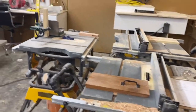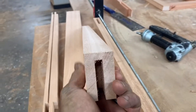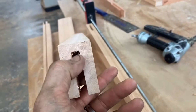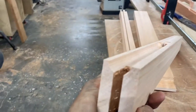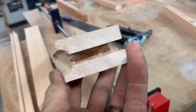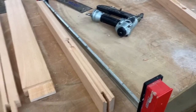I'm trying to simplify things instead of complexify — so one and a half inch tenons. I'm going to show you: when I put the pulley trough in here it's going to make total sense that I don't need to go all the way through. Here's my pulley trough I just made, and you can see that pulley trough totally eliminates any need for a tenon to go all the way through. So that's an inch and a half tenon all day long.